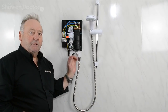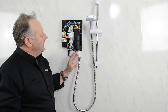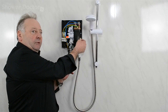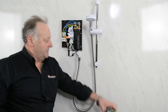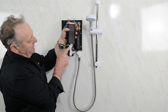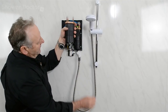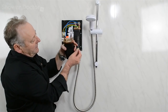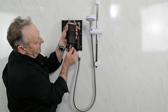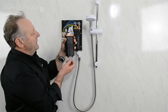This pressure relief device is tucked in around the back of the outlet pipe here. Normally in a Triton that's where they are — somewhere at the bottom of the tank or in the outlet pipe, and occasionally attached to the side. This is a tank that's very similar in a Triton, and the pressure relief device is tucked in around the back here, held in with these two legs. When you pull the outlet pipe out, you have the pressure relief device here. Inside there's nothing more than a small ball. When the pressure builds up inside the tank it blows the ball out of the bottom of the pressure relief device and lets the pressure out — it's a safety valve.